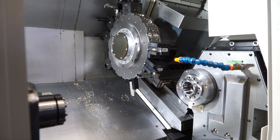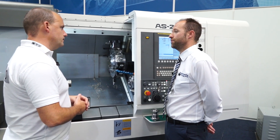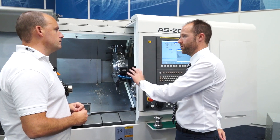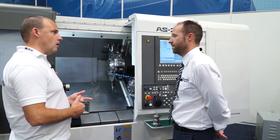So what is the turning length? On this machine it's 570mm. And what about the turning diameter? 340mm. Bar capacity? 65mm on the main spindle, or we have an option to step up to 71mm. So you can go bigger than the 65mm bar capacity. Yes.